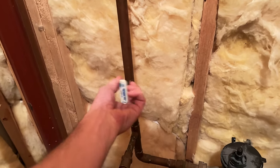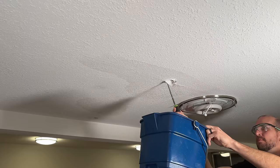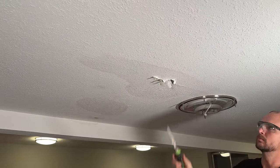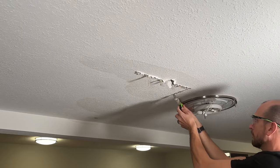First, figure out where this water leak is. If you have an active gushing water leak — I just have a drip going on — go shut off your main water shutoff valve to minimize the damage to your flooring and other parts of your home. Then once that's shut off, we can investigate. I like to use a jab saw to cut a small hole first to drain any standing water before cutting a larger hole, and I'm also looking for Romex, insulation, or anything else in the ceiling I might damage.